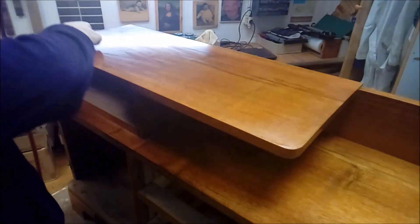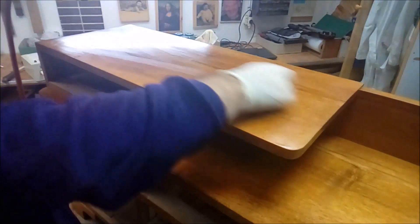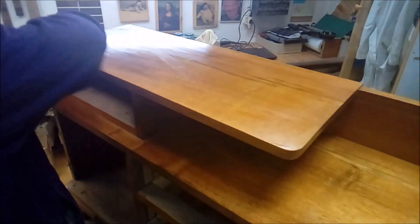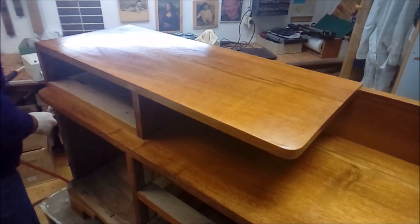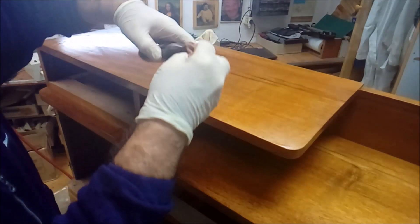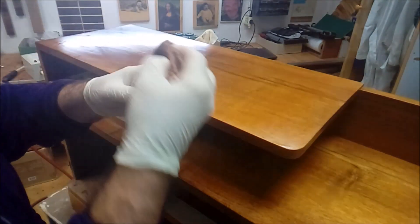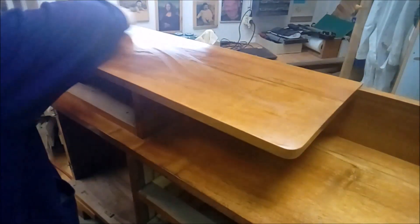One by one layer with intermediate drying. In the video, I will not show the filling of the pores with pumice, which is a prerequisite for a smooth and shiny surface. When a completely smooth and fully primed surface is reached, we start polishing the surface with linseed oil. The oil is added to the rubber only in droplets, as it should be completely removed from the surface if it does not become completely cloudy in a few days. The oil serves as a lubricant to keep the rubber flowing nicely and not sticky to the surface.